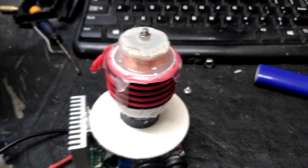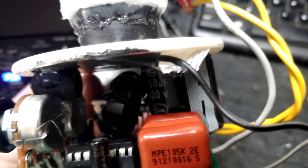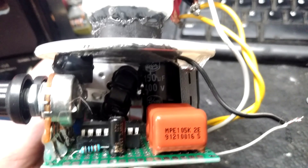So here's the first little test circuit setup. I've got this little GDT in there that I've got about 7-8 winds on. I've actually removed the smaller parallel caps I had on there that really weren't doing anything, and I just threw a larger one on there — higher voltage stuff I had laying around.